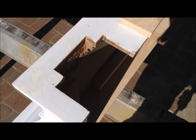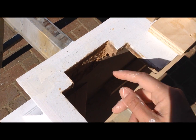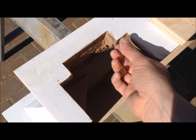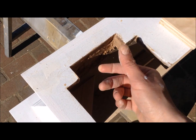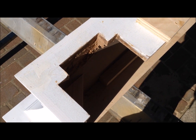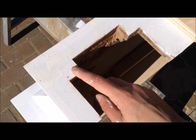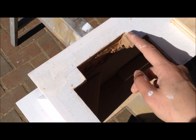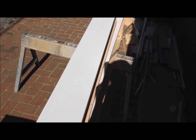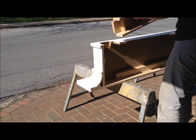I don't know if you could see it in the video, but that piece I had in here snapped off when I tried to lift up this mantle, and I kind of foresaw that coming because it was only connected by a little bit, and MDF is just not super structural. So this is kind of the opening I'm left with, but luckily the legs, the way I cut them with these little tabs here that hang up on the cutouts on the mantle, still work just the way it was intended, and you could see that that one over here is in place.